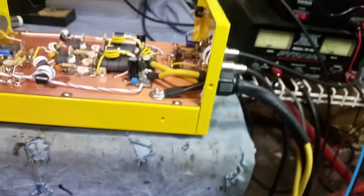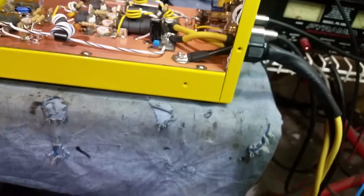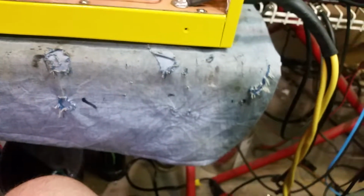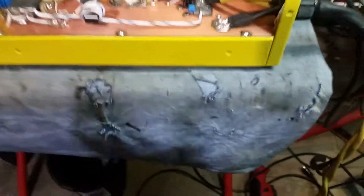You run this thing good and clean, you know, run it 600, 800 watts peak, it'll last forever, man. I mean, you ain't got to be running it at 400, 500 bird all the time. If it was my box, I'd probably run it about 300 bird and just let it roll, man. That's the way I like to run my stuff. Hell, 250, 300 bird in a mobile, it'll last forever. But the gain is there if you feel like you want it. So, all right, bud. Well, I'm happy the way that turned out, man.